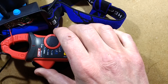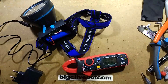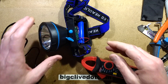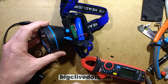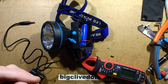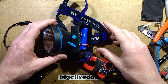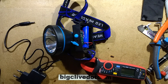An interesting light, but the beam is just odd. The fact it is so highly focused is extraordinary — I'm not sure what they intended this for. It just seems really odd that it's got such a tight beam. It's entirely mechanical with no electronics in the switching, which makes it very fixable and serviceable. You could put a new LED in if you wanted, since 1-watt and 3-watt LEDs are dead common. If a super tight beam is what you need, this will do the job.